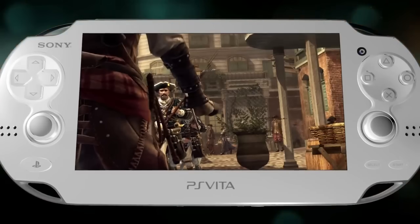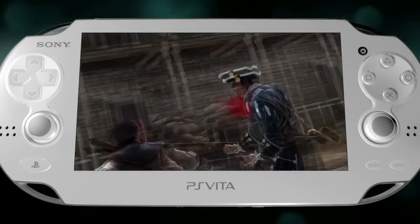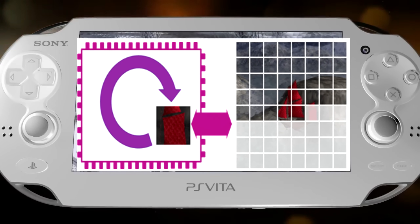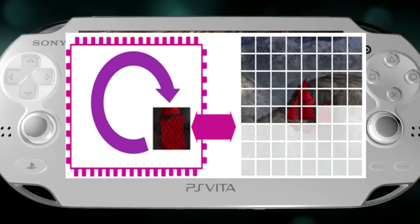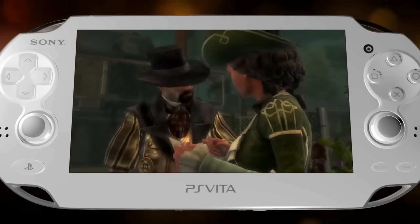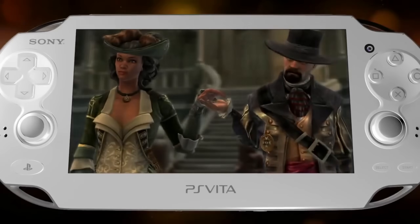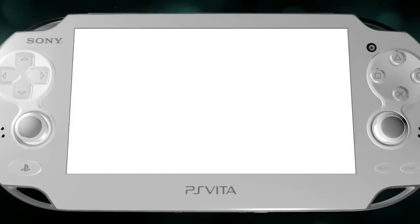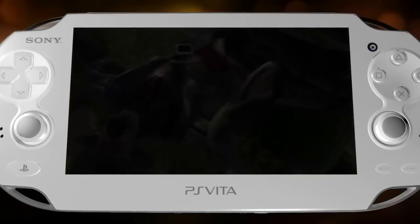To handle rendering, the GPU used tile-based deferred rendering, or TBDR. This technique divides the screen into tiles and processes each tile independently. By rendering only the visible pixels within each tile and culling geometry early, TBDR drastically reduces overdraw and optimizes memory usage, which is particularly useful in a mobile gaming device that has limited capabilities by nature.